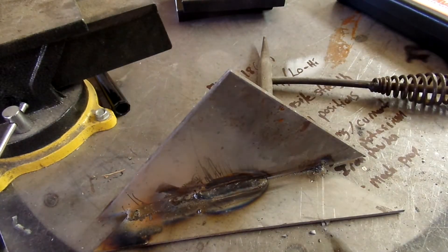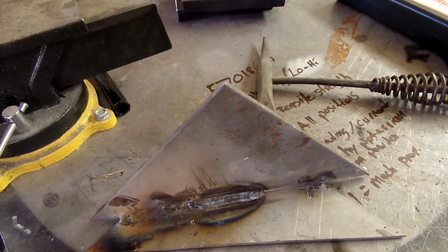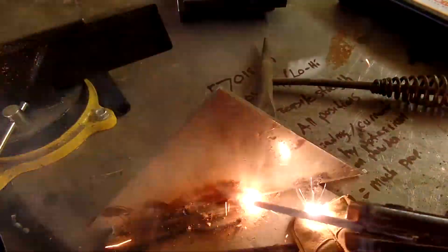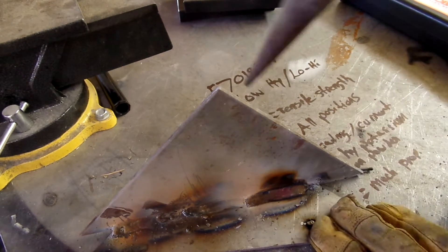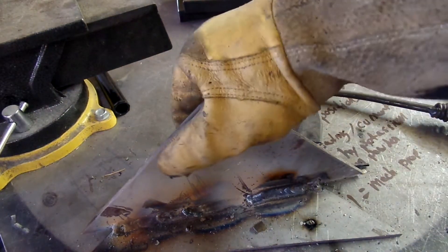It's a lot better. I could use a little more heat, so I'm going to bump up another 10 amps — we'll be running 120. I've always liked to weld a little hotter than normal. We've got a little bit of electrode left, let's finish her off. That felt real good. The start on these is terrible — we'll see what we can do in the settings to adjust for that. The slag is a little sticky, but that's not too bad.